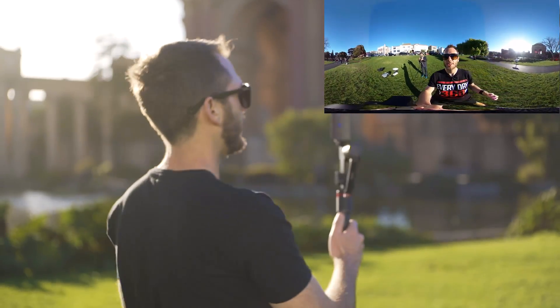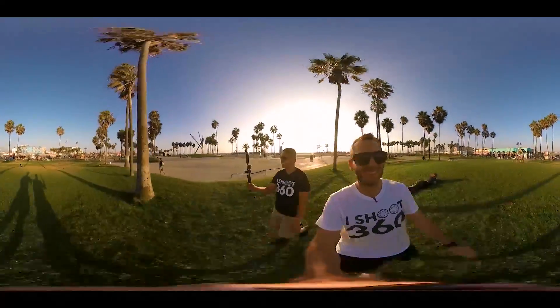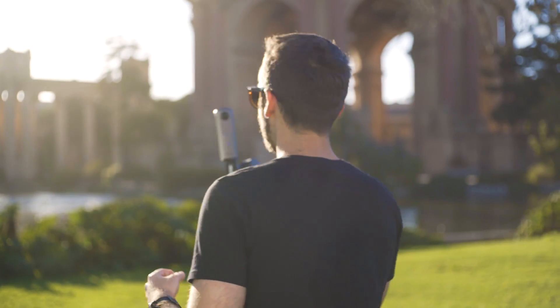Something this has over six-axis stabilization like with the Insta360 One and the Xiaomi is a follow mode: if you double-click the main button, it turns with you. This is essentially the same as follow mode with the Garmin Virb — one of the best things about the Virb. With the One and the Xiaomi you go from one side of the equirectangular video to the other, whereas this lets you stay dead center because it pans with you. You can choose to have it pan with you or keep it in a fixed direction — it gives you more control over your stabilization.